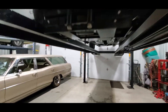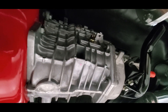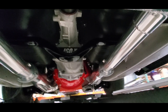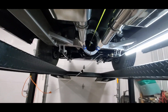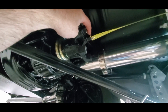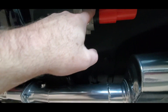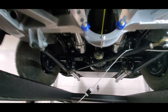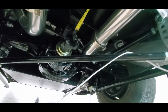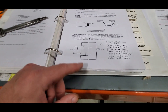I've got a couple other things I want to do while she's up — a little bit of wiring work. A neat little trick when you're working by yourself is to chuck a magnet on there. I've got a magnet holding that end and I've done it from all four of them. This machine surface here always comes out at that 54 and 3/16 to 54-quarter range depending on which one. We're going to go with the shortest, which was obviously this one, and that's going to be 54 and 3/16ths.